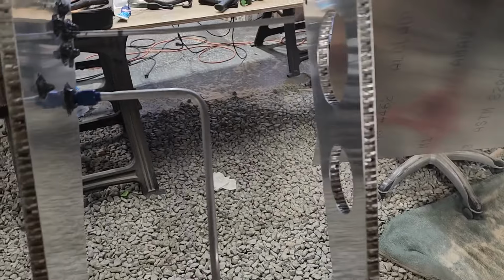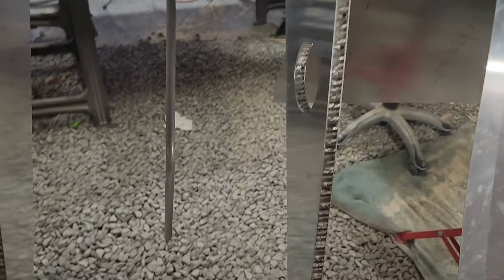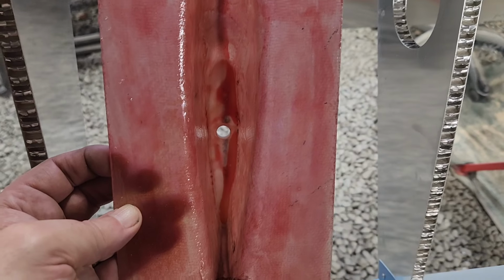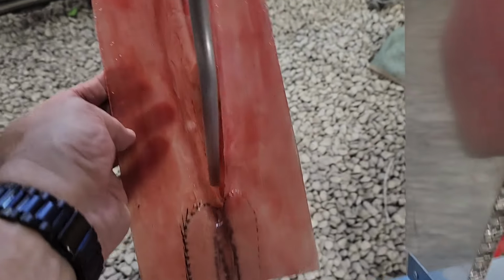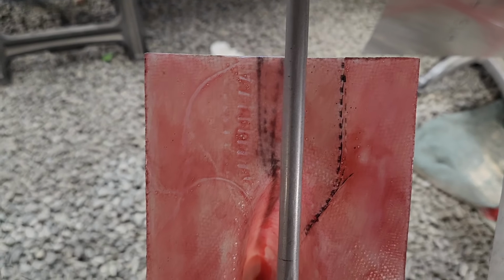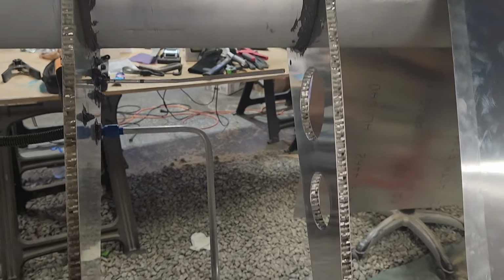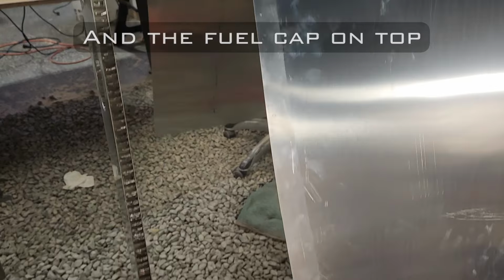And then when I go to put the skin on, the skin will go on the bottom edge first. And then once that is on, you keep the skin kind of off the top. Put this in, make sure it's all Pro-Sealed up against the metal, as well as the retainer clip. There's also a retainer clip that mounts there, just to hold the pipe in place. Everything else I think is ready to go. It's just a matter of doing this and making sure I understand exactly how to Pro-Seal this.